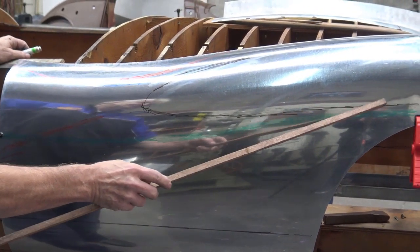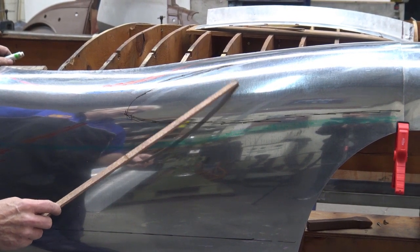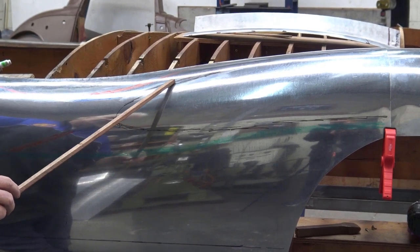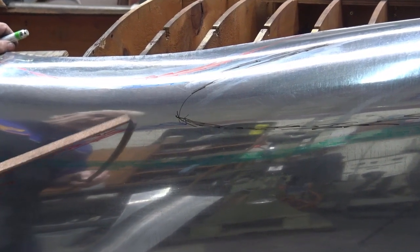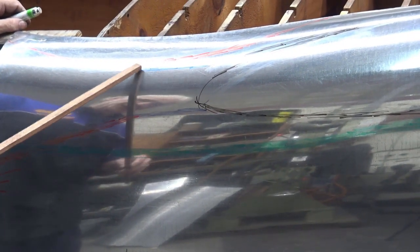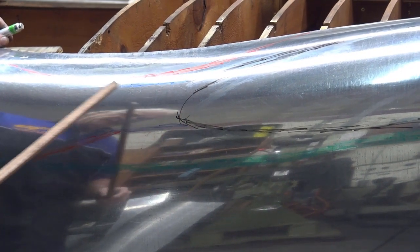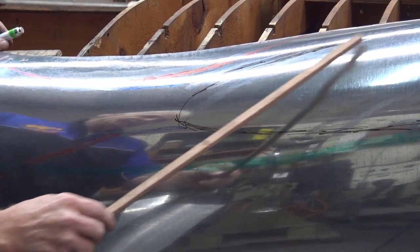This black circle here shows the funnel, where most of the shape is. Okay, and then of course it comes down, and we've got a blend between the reverse here and this reverse here. The blue lines represent straight. It's dead straight, because as I mentioned to you before, you can't have a return and immediately a bulbous shape. It'll look funny. So you've got your reverse, your straight part, and then your funnel out.